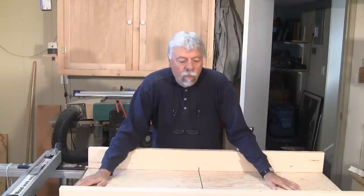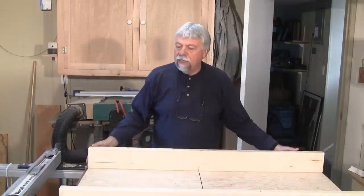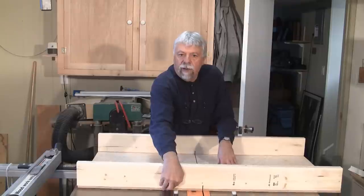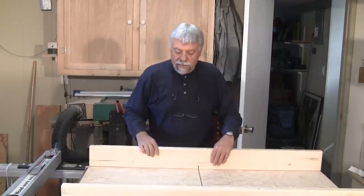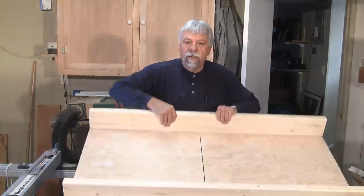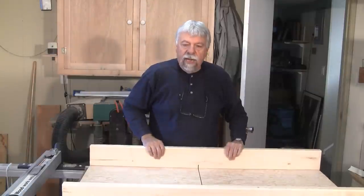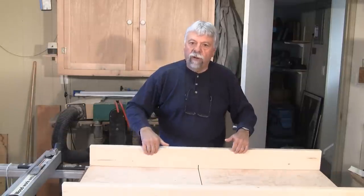We were using half-inch, four feet by two feet wide, good quality plywood. We fastened it to the blanks by lining up the back of the board with the back of the saw — the slots were already in place. We did countersinks on both sides and put in screws. When we were finished, we were amazed at how easily and smoothly this moved back and forth.